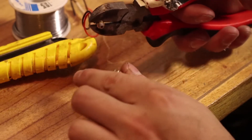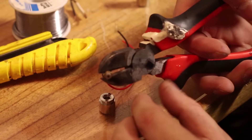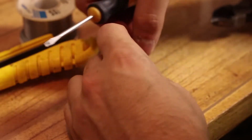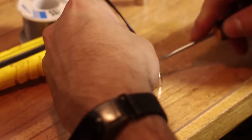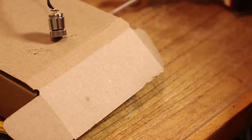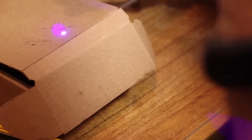We're going to remove the laser diode that the module comes with. Simply with a pair of pliers, we pull it up and it comes out. In that same place, we're going to put the new diode — the diode we took from the Blu-ray. All diodes of this type are the same. There are others called open-can that you may not find, but we're going to work with these, and you'll see they're all the same.